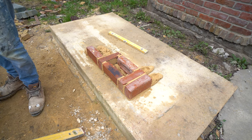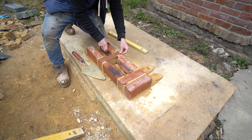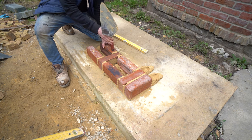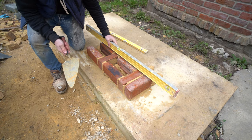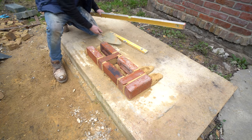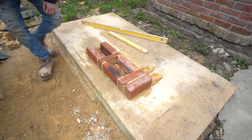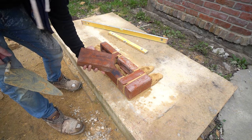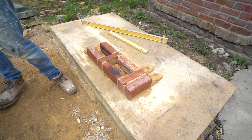I guess it's only strong if you fill up the cavity with concrete — though that's more of an application than a design requirement. You can either fill it up with concrete, leave it empty, or fill it with insulation. Obviously cavity wall construction is a lot better than this — you just tie it together and off you go — but bonds like this will continue to be around. I've heard a lot of people in the comments saying their houses were built with rat trap bond.